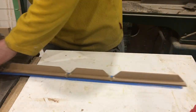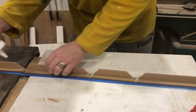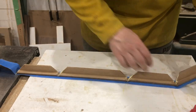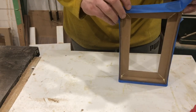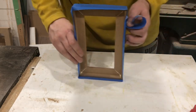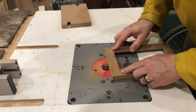One little trick I use when making a picture frame or anything like a picture frame is I mount all my pieces to a piece of tape, making sure that the pieces are nice and tight against each other. Once you're finished that, you put in your glue and then you just fold it together and it comes together almost like origami. The tape is more than strong enough for something as small as this, so this is a super easy way to put together your picture frame. Just wait for your glue to dry.